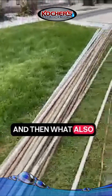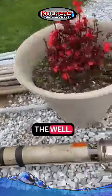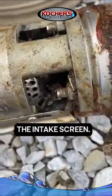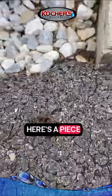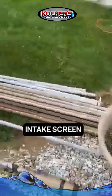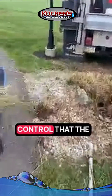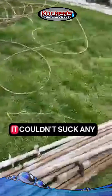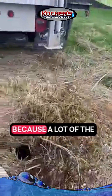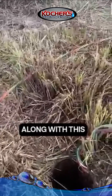A mouse fell down in the well, and the mouse is in the intake screen — here's a piece of it too. It fell into that intake screen and actually gave a signal to the control that the well was dry, because it couldn't suck any water up through the intake screen with the mouse and grass jammed in it.